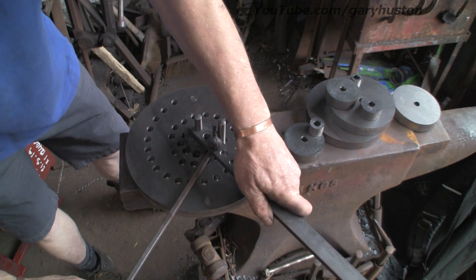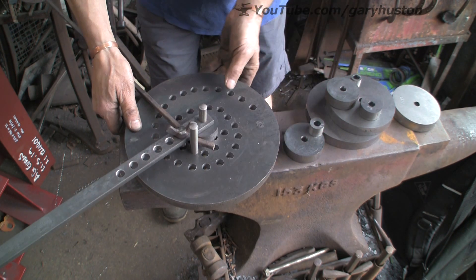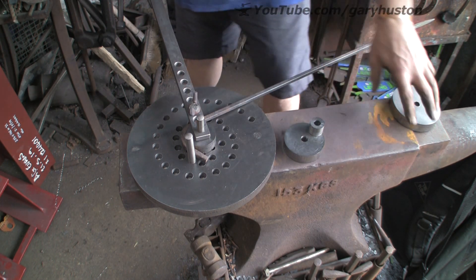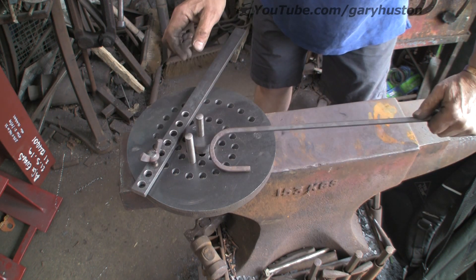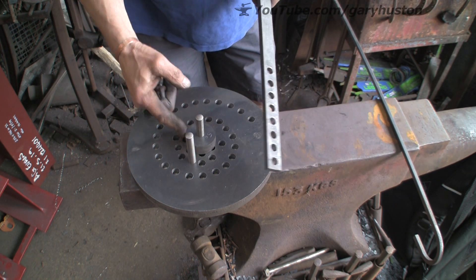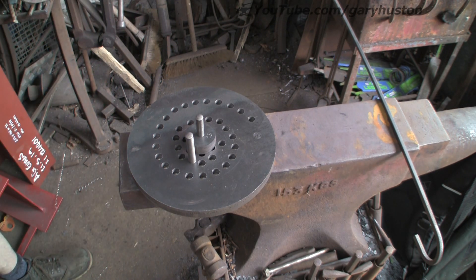Let's see if I can just do this bit cold. I really need to move the jig — come on Garrett, move the jig round, that's better. There you go — quite easily. Of course this is in the way now. That moves around quite easily and produces a nice even bend. You could go right the way around — do whatever you like with it — but I wouldn't go any more than 8mm square cold because you can break these pins. And when you do it hot with the bigger stuff, make sure it's nice and hot.